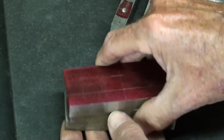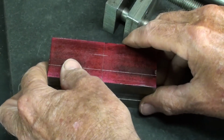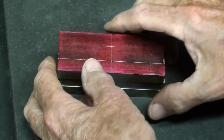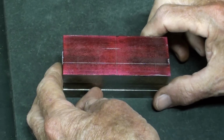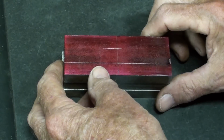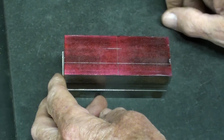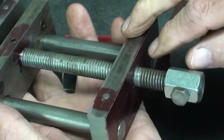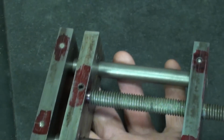So I'm going to take you through this one step at a time on the bridge, not the Bridgeport, the South Bend. Now this is really the first project I've ever made with the South Bend milling machine. And again, it's not totally up to par, but we're going out into Studio G and do all of that work. I will also do the tapping while it is in the milling machine, so we have a perfectly square threaded hole. Or again, it will bind.